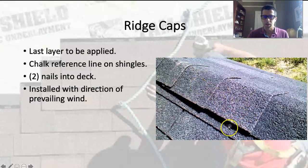This is what our ridge caps look like. See that nail shining right there? You don't want to see that. The only time you'll really notice if your shingle courses aren't straight is this last row, where you have the terminating course of shingles running parallel to the ridge caps. So chalk a line on that last course and use it as a reference when installing ridge caps. Some people run ridge caps from both directions meeting in the middle, but I tend to run them with the direction of the prevailing wind, so it blows over the lip of the ridge cap.